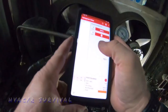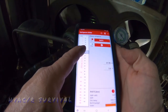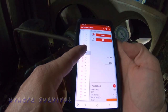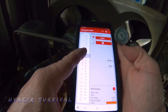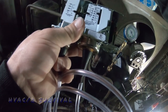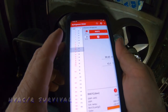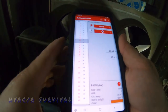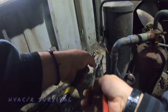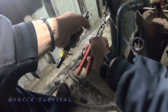Now we're going for the low side — we want the cooler to be running. You figure a vapor temperature is going to come up to at least 30 degrees, so there's 50 pounds. Set it too high and if it's cold outside it may not come on. Let's go about 30 with a 25 differential — 30 psi is going to be 13 degrees, so with this refrigerant it should be high enough that it won't have an issue coming on in the winter. We put a little Nylog on there, snug her up and then back her off.